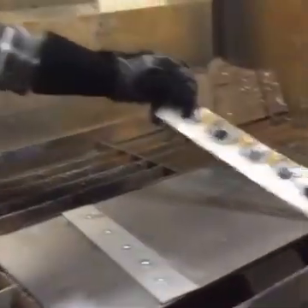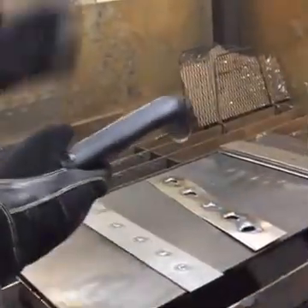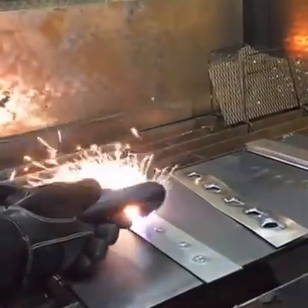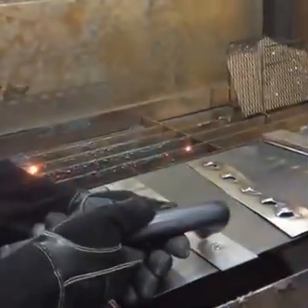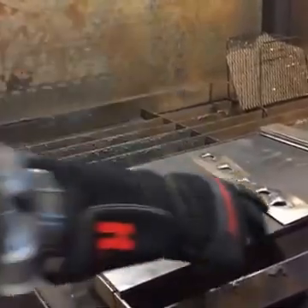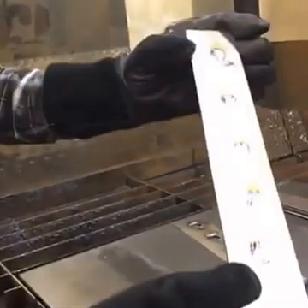There we are - you can see it separated right off into two pieces of metal. I'm going to leave a little bit of weld at the bottom, but I can go back with the plasma arc and wash all those away. There you have it, Facebook fans - five spot welds gone in a matter of about two and a half minutes. Beat that with a drill.